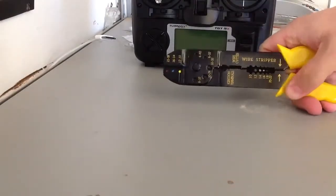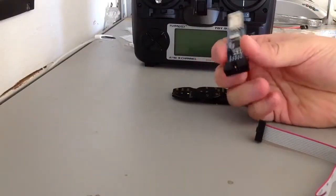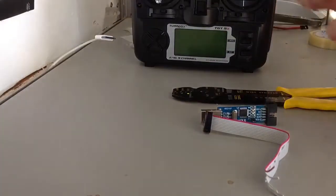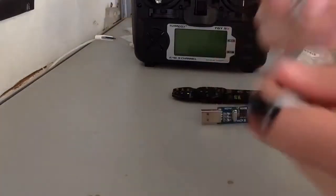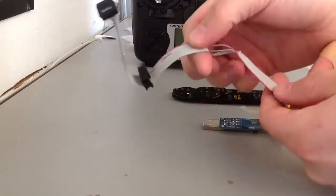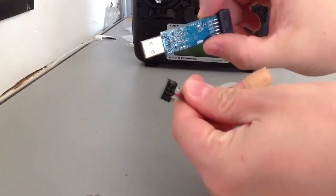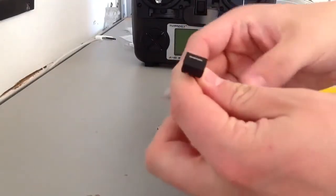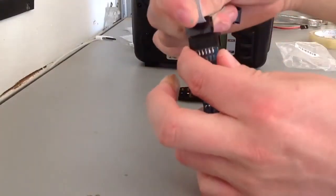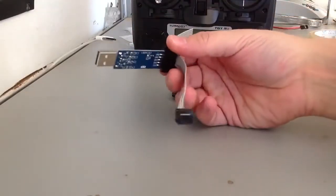You're going to need some wire clippers. I ordered this off HobbyKing for five bucks — it's a USB connector that connects to the computer. I snipped the wires in half and split them. This is actually a plug I can use to plug into my KK2 board, and use the other end to plug it directly into the USB to flash the KK2 or flash ESCs.